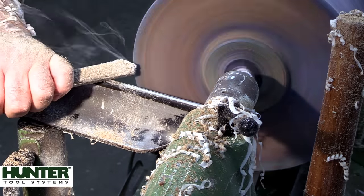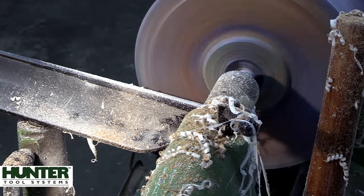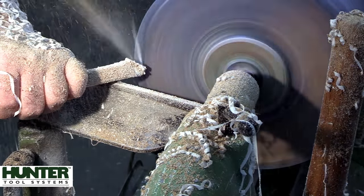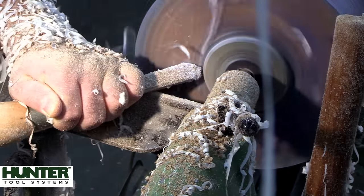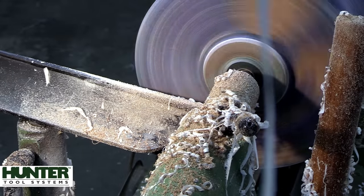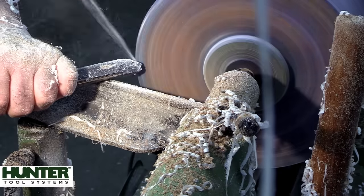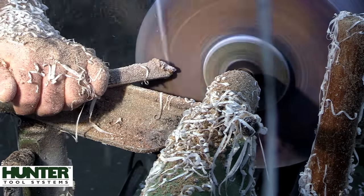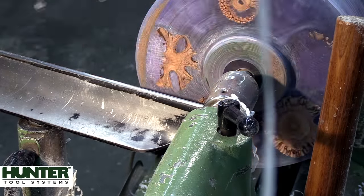So what I want to do here is turn a tenon, because we're going to reverse this and put a glue block on it like I typically always do. I will say that the combination of this hardboard, or MDF, medium density fiberboard, if you've never worked with it, can be so hard that when you're running it through your table saw, you'll actually see sparks coming off your blades. It's a real tool killer, if you will.